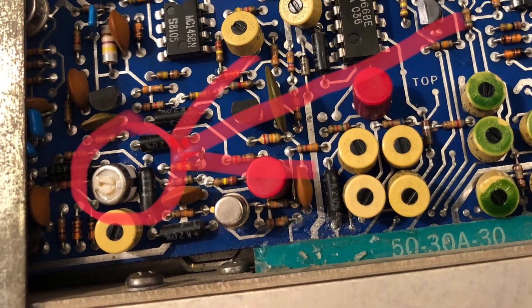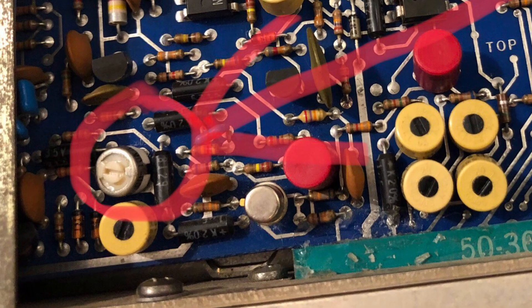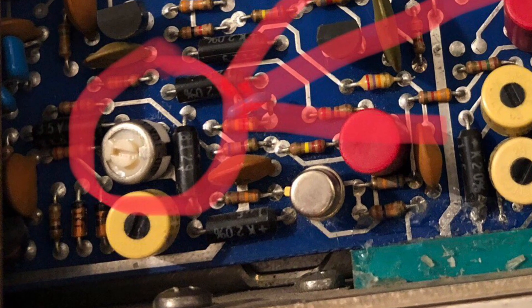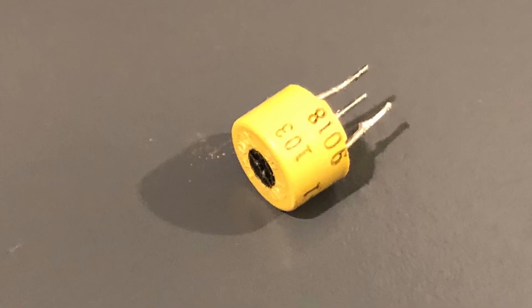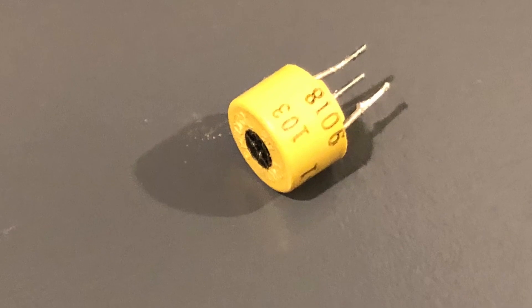To cut a long story short, although it looked like a dirty edge connector or a dry joint, the fault turned out to be the narrow band gain adjustment trim pot itself. Replacing the 10k pot allowed full alignment, giving proper operation of the squelch and yielding the expected receiver sensitivity. Replacing the trim pot removed all traces of touch sensitivity — so whoever applied that silicon sort of disguised the symptoms but missed the actual fault.